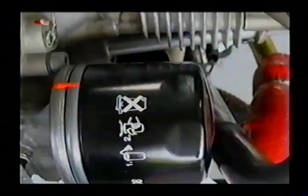We do use an automotive-style filter, but it is not an automotive filter — it's one made specially for Rotax by Champion. You want to make sure you use the Rotax filter because it has a higher bypass pressure release valve than a standard automotive oil filter. In a standard automotive filter, they don't anticipate customers starting up the engine in the morning, letting it run two minutes, then firewalling it — but that is what we anticipate many of our customers will do, which puts tremendous strain on the oil system.